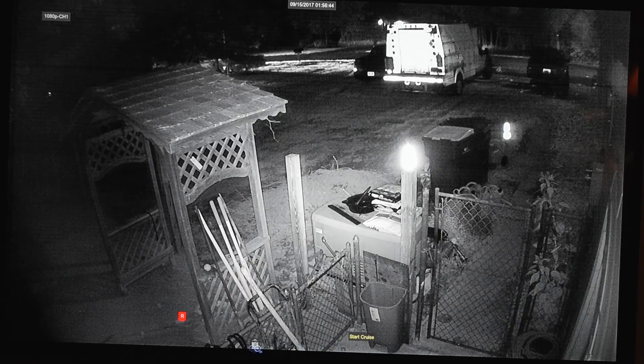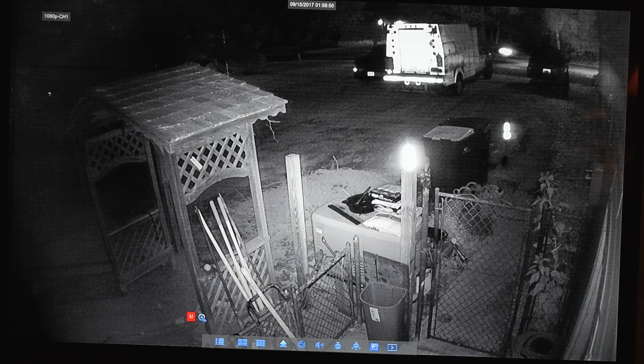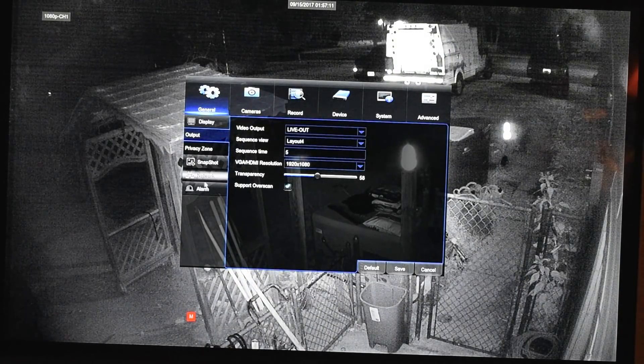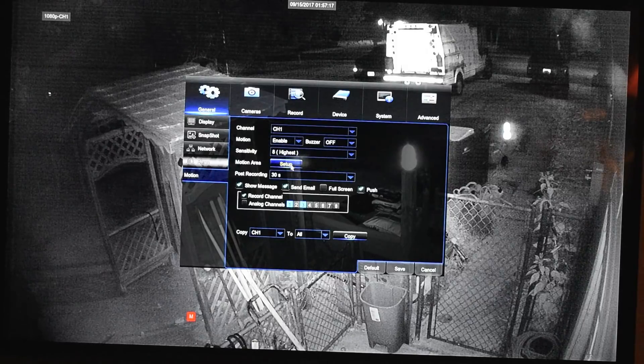Down here is the main menu where you can see a couple different things. It's in motion recording — you can see when it triggers it switches to manual. The only really useful buttons here are either the main menu or the playback button. In the main menu the important thing is you can go to alarms for your cameras, which is really useful. You can tell the camera where to record and where not to record. So if you always have bushes that move over here, you can tell it to ignore that area — everything in red is what it actually records.